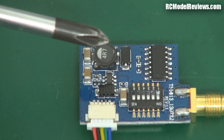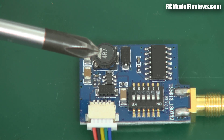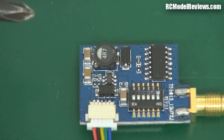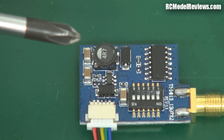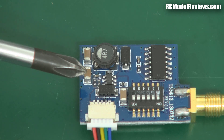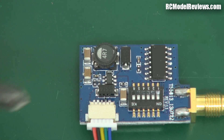What this does is take the input voltage — which can be up to six cells on some of these — chops it up into small bits, and puts it back together as a lower voltage. So we have a coil, some capacitors, and a little switch mode controller. One of the problems is that because you're chopping up the input voltage into small pulses and then making it back into DC, you get noise. On this particular design there are two capacitors designed to filter out the noise, but the value of these capacitors has varied wildly from sample to sample.